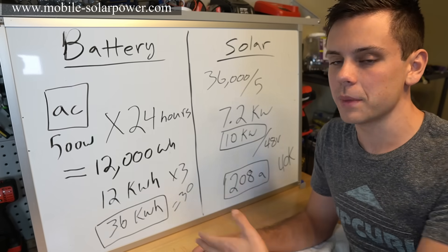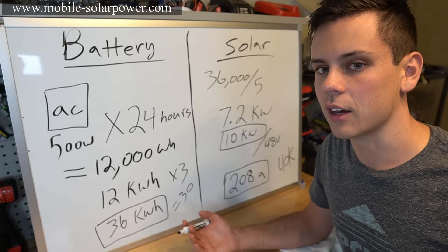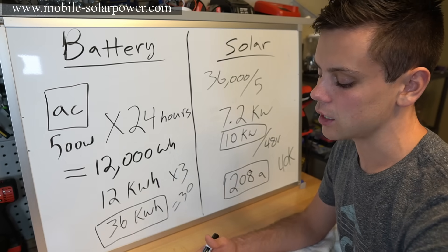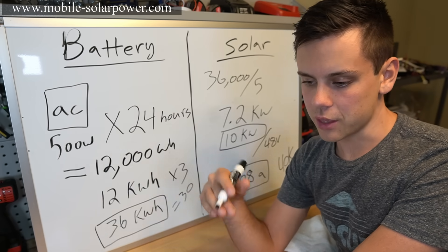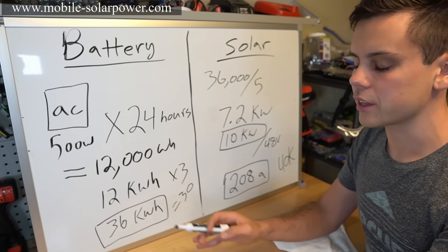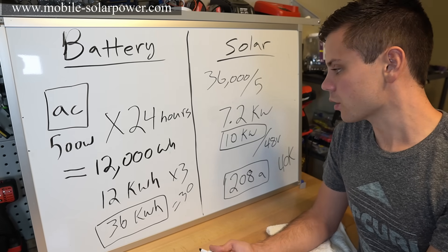When over-paneling, make sure you have current protection and voltage headroom — typically about 25% above your maximum expected voltage. UL-listed controllers usually have built-in over-voltage protection. Cheaper controllers use lower-rated capacitors and can burn out instantly if you hit the voltage limit, whereas a quality controller can handle it for years.